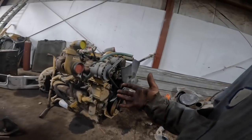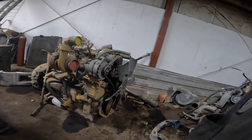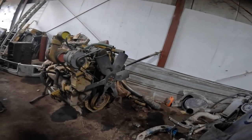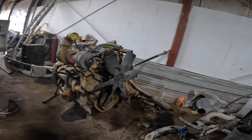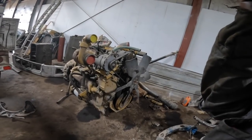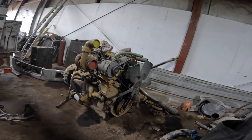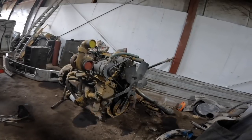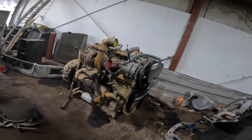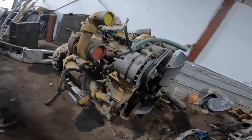And then by the time they call you, the starter's run, the batteries are completely run down, and it takes you three times as long. I went over there and basically checked power and ground at the ECM. I had power and ground there, but I couldn't communicate, and I only had half a volt on the one CCD line on the data link connector on the 1708 six pin, which is usually not enough. It usually takes about a volt, volt and a half. I suspect the ECM went bad, but they had stuck a brand new lift pump on it, and I wasn't getting the kind of fuel pressure I was normally accustomed to seeing on those. But it's hard to say when you can't get the thing to turn over fast enough, because the batteries are so screwed up from those guys cranking on it. So it's frustrating. I called him, said get some batteries for it, and then I'll come back. So anyways, that's my complaint about that.